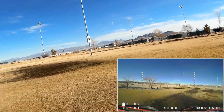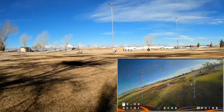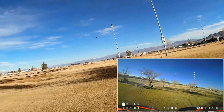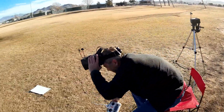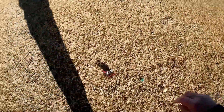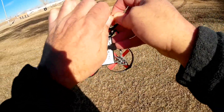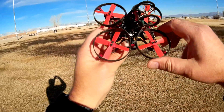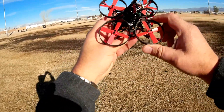Okay, let's bring it in — I'd say it's at 6.5 volts. Back to 6.7, we'll stay there. Let's take it down one more time and get a run going. At 6.2 volts — coming in. Overall, there's a lot of power in these motors. You can see this thing could really move. Let me unplug this battery and take a quick look at the blades. Yesterday's blades had little white marks at the base, but I don't see them today — maybe that was just from the crash itself. Flying normal maneuverable acro was no problem at all. I'm not sure what happened with that accident yesterday.